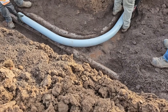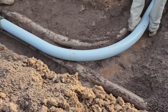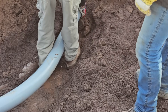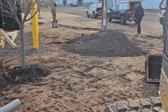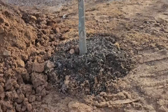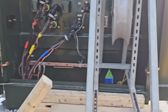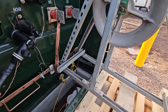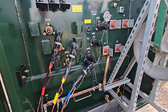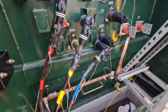They're just about ready with their new 90 there, putting in a brand new pipe. They'll have to blow a line through that one in order to pull the bull rope through. This is all contractors again - that's not up to us, we don't own that equipment. We do own the pad mount transformer and we do have to be on site if a customer is pulling wire in through our transformer. They've got what looks like a 5,000-pound block set up and a custom-made mount which looks pretty decent - I haven't seen one like that; looks like it's going to work pretty good.